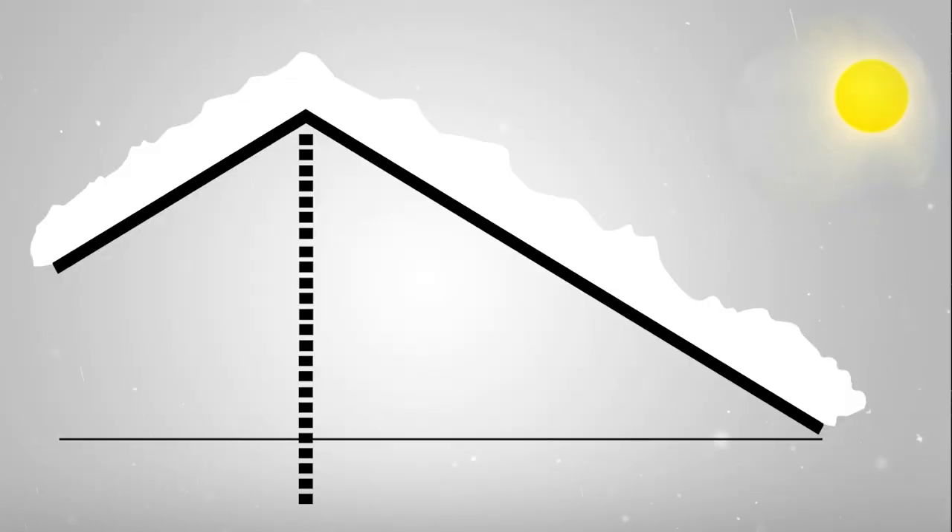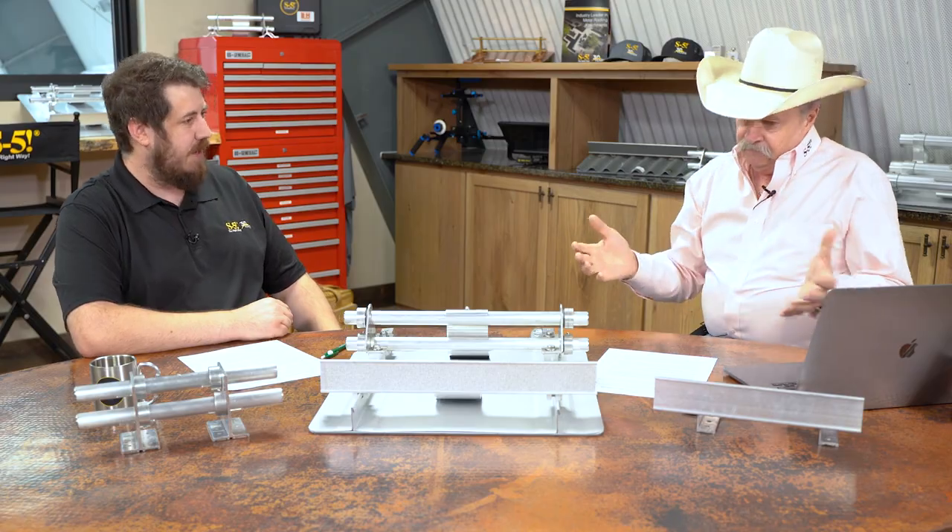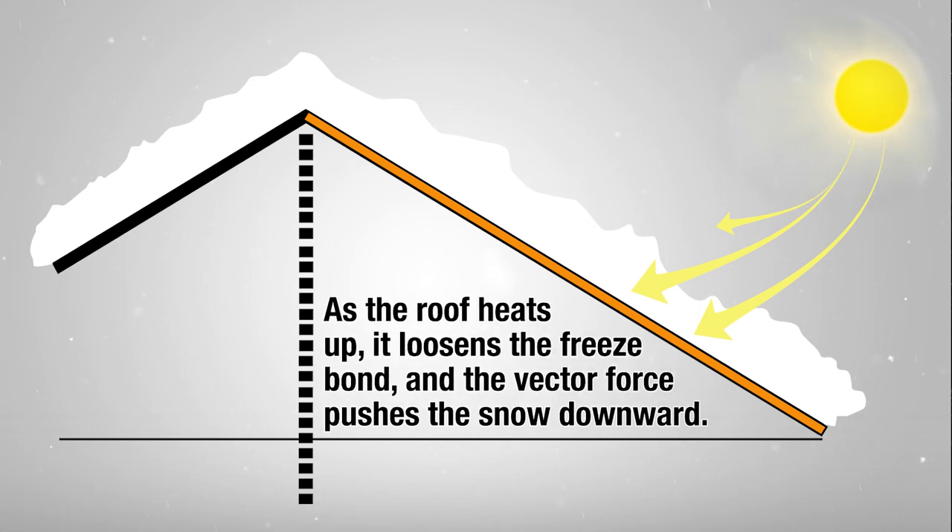What happens next is that when the sun comes out, the rays of the sun shine through the bank of snow. These are the invisible rays that warm objects, and the blanket of snow is somewhat translucent — those rays pass through the blanket of snow and start warming the roof below. This can happen even when ambient temperatures are well below freezing, because the roof below is insulated by that blanket of snow and is getting warmer from radiant energy from the sun. It warms up to a point above freezing and now that snow blanket, where it's adjacent to the surface of the roof, starts to melt and thaw.